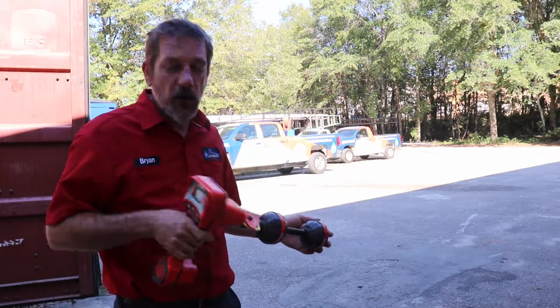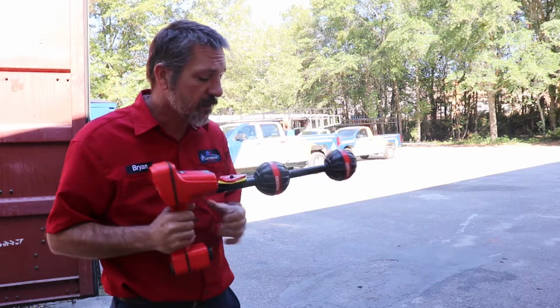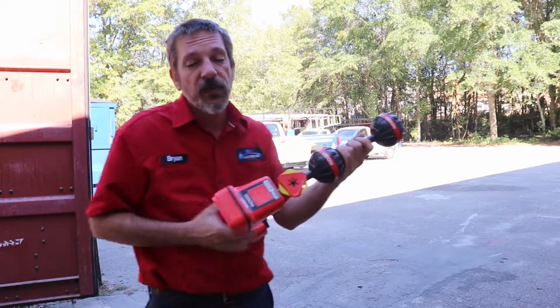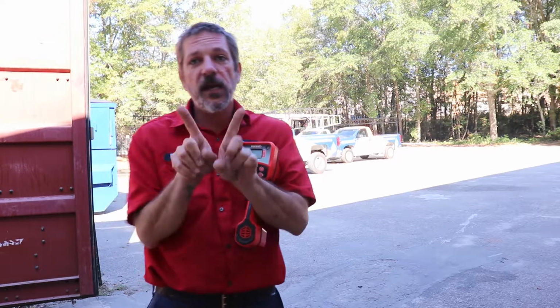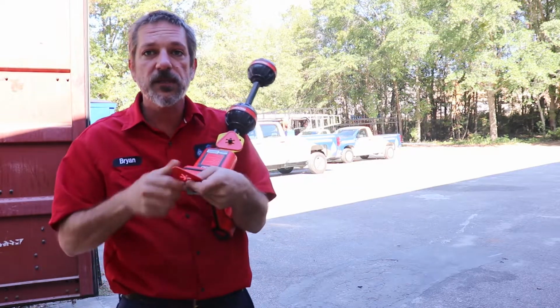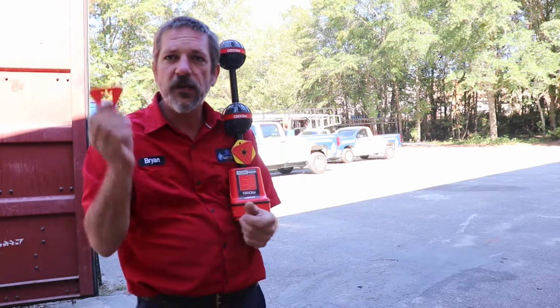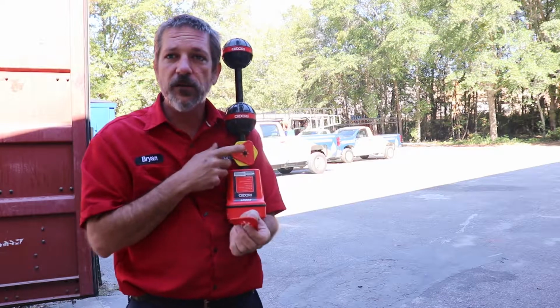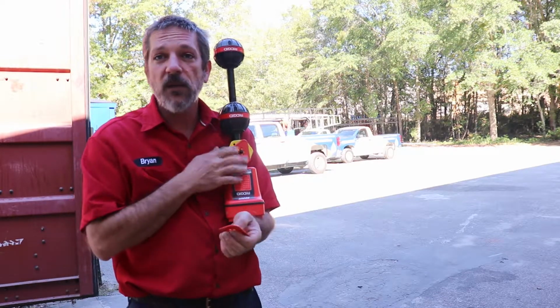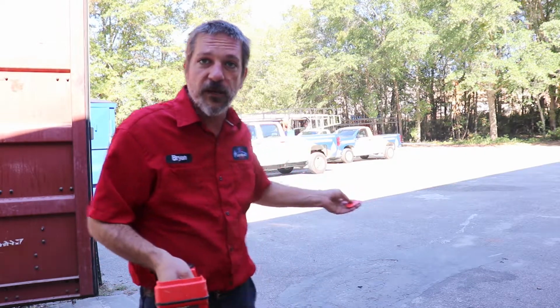All right, we've got everything turned on, and to do our location, we're going to be walking around out here watching this screen trying to find two little targets. A lot of people don't know that you're looking for two of them, because the way this camera head works is it projects a signal out into a V. It does that so it can use the distance between those two points to know the depth of that camera head. Now this locator comes with these little chips. There's two red ones and one yellow one. The point is you're going to drop this red chip on the first target, drop the second red chip on your second target, and then you know your camera head is going to be right in the middle of the two. So let's see what we can find.